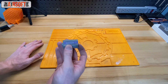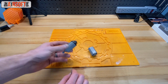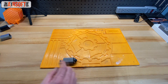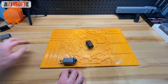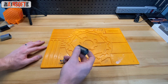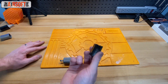This is a Kioli motor right here — it comes with Chinese lettering and you can see the actual name brand right there, which confirms what it is. That's what you need. The next thing you need is a neodymium can — this one is out of an SHS motor, a little older, but that's okay. The only parts we're really utilizing are the magnets and the bearing to a small degree. An older airsoft motor bearing won't be detrimental in a typical setup.